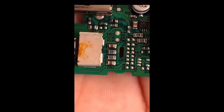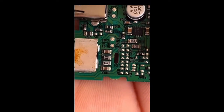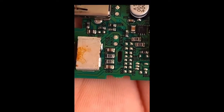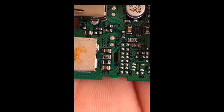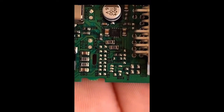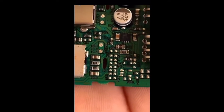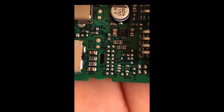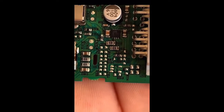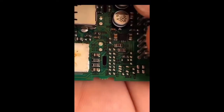After holding this in hand, can you see these numbers — triple two? The last two stands for double zero, so you place 22 and double zeros after that: 2200 ohms. The resistance is 2200 ohms — that is the actual value. That is the way to decode these resistance codes. We have to bypass them and that should work.